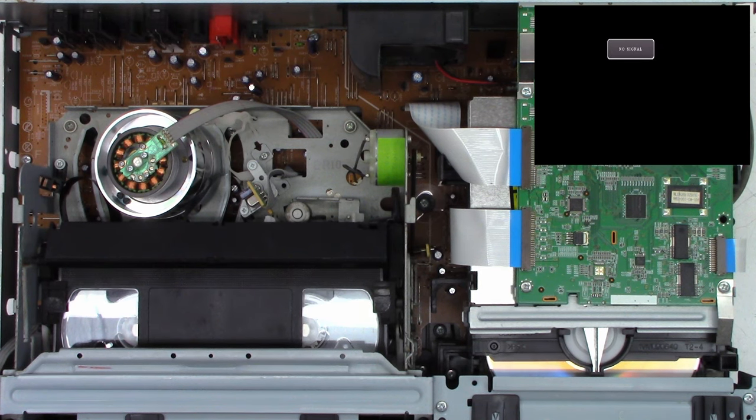So, basically, I want to go ahead and replace the main filter cap just because of the issues we had. And I think I'm going to check a new 1000 at 6.3 and see what it reads like. One moment. Okay, so this is a brand new 1000. Let's zero the leads out. They're perfect. This is a Nichicon 1000, and it reads 0.3 ohms.